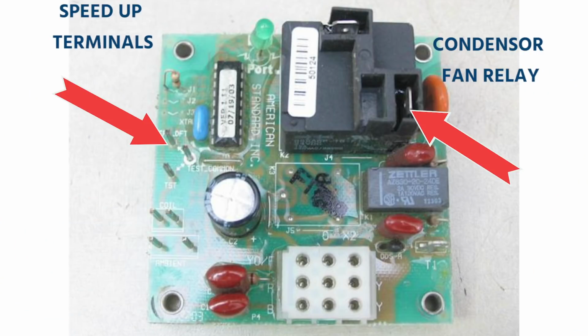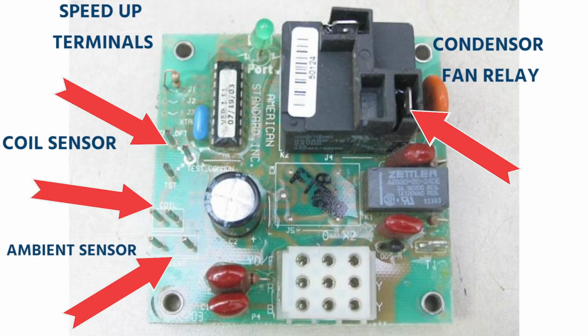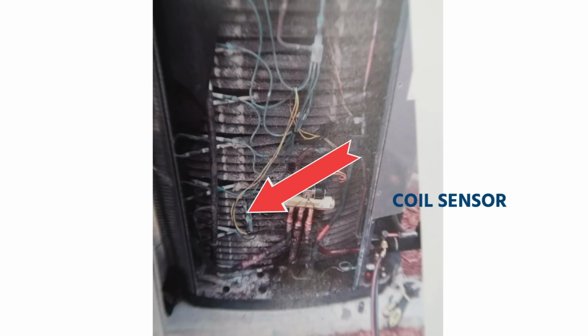So Trane defrost is actually very, very simple. You have two different sensors here. You have one for the outdoor ambient sensor. It tells you what the outdoor ambient is into the board with the resistor, and also your defrost, your coil temperature. But coming from your defrost board, these yellow wires trace back into a little tube. Inside that tube, they put the little resistor inside there and zip tie it in, and that reads the coil temperature. Much like the clixon in the Carrier system, but it's actually read by resistance.